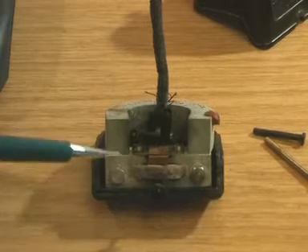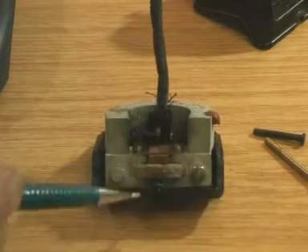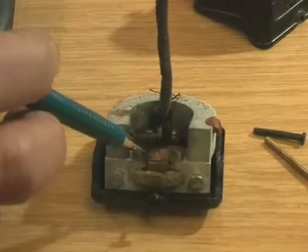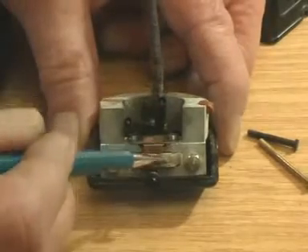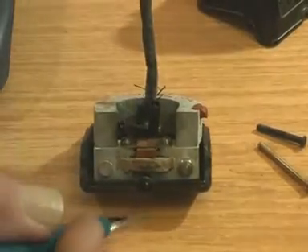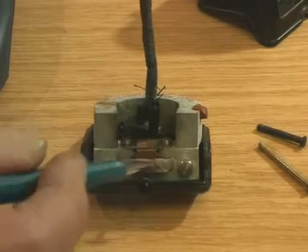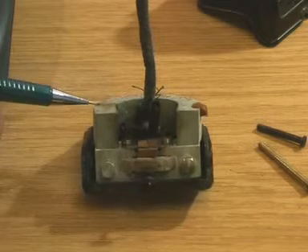Here is a horseshoe magnet, pole piece, and a coil. Here the needle pivot, which is an armature, the top of which is damped by this rubber that you may be able to see. And here is a coil of extremely fine wire. The groove of the record vibrates the armature and generates a voltage in this coil. Unfortunately this one is open circuit.